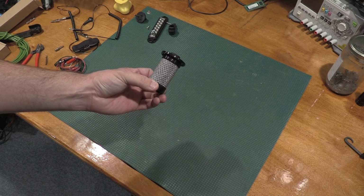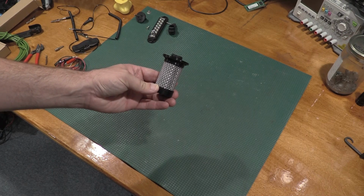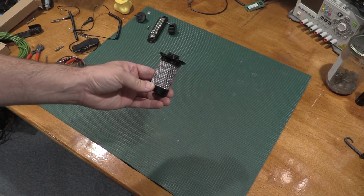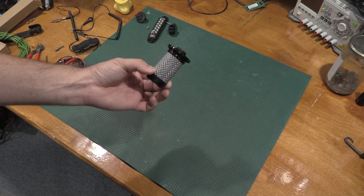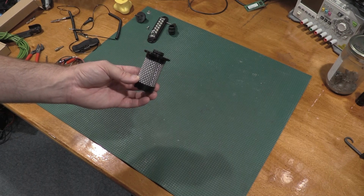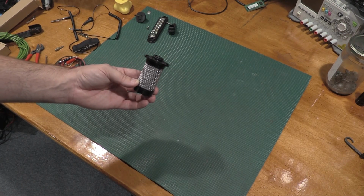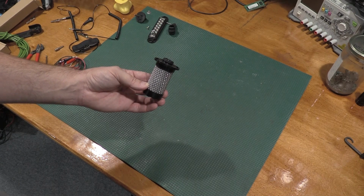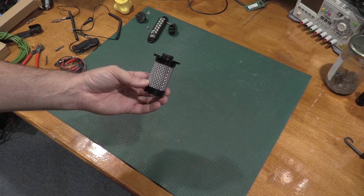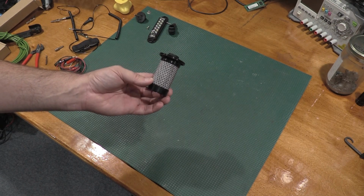So this is the carbon filter that comes out that is in the airline. If you have questions, I'll leave a link in the description below to the airline video of where I talked about putting these in. The N2 filter strips out the oxygen, leaves the nitrogen, dumps the oxygen into the room, and pumps the nitrogen concentration through the iron to get hot, because it passes the heating element and then comes out as hot N2.